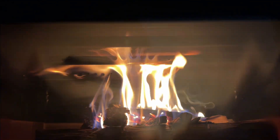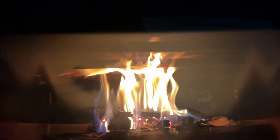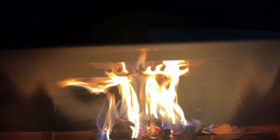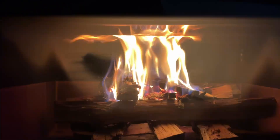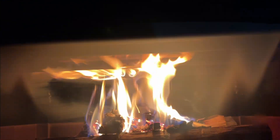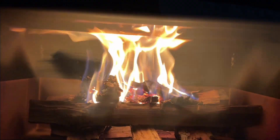You can kind of see that secondary burn going on now, so we're heating up the baffle. It's just burning that top layer, but it's heating up the baffle, running through those tubes, heating up the flue, and all that will drop down into your next layer of wood.